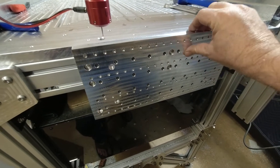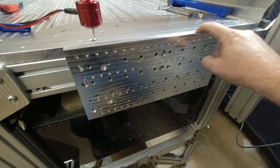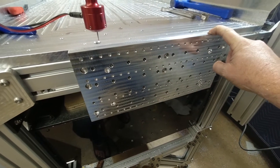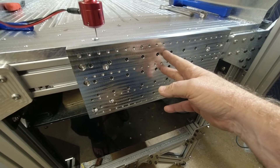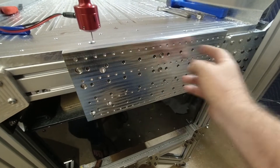When fitting a front plate I normally like to tram in this machine line here. To get that dialed in exactly right I tighten up these two bolts here, nip them up, and leave the two inner ones loose.